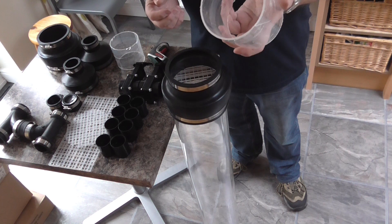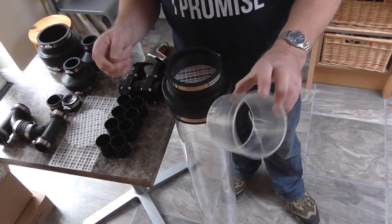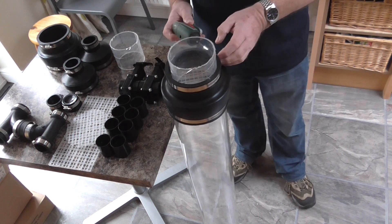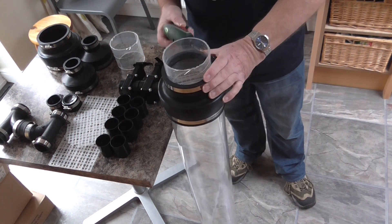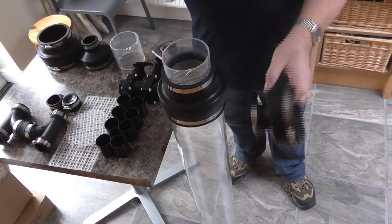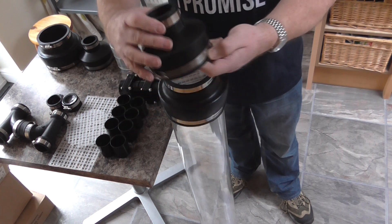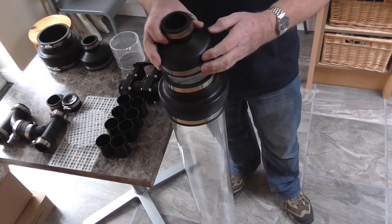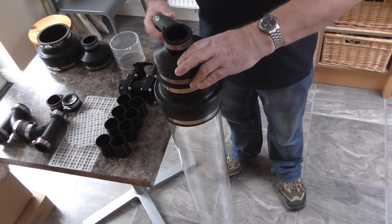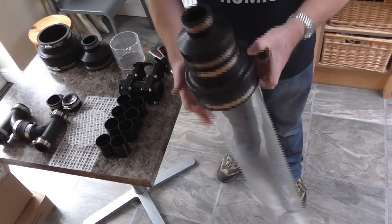Next, this is 110mm pipe - it's the clear pipe I've used, but you can use standard 110mm drainage pipe, the brown stuff that goes underground. Just cut a piece so it'll fit in there like that. Next we use another adapter - this is a 110 to 1.5 inch, which is 40mm adapter. Another rubber adapter and we put that on top like that, tighten that up. Okay, that's the top done.